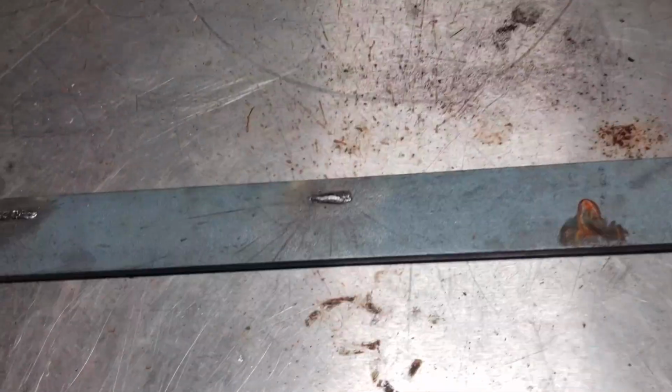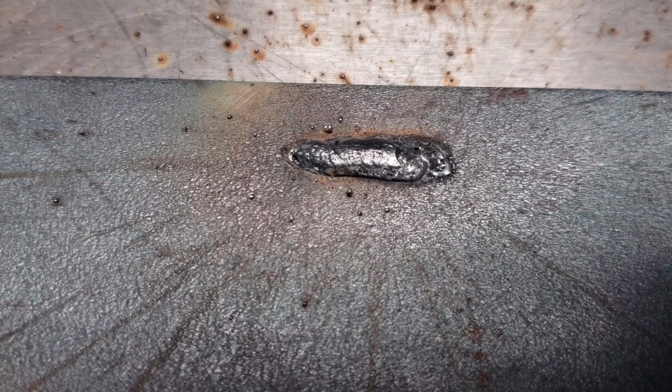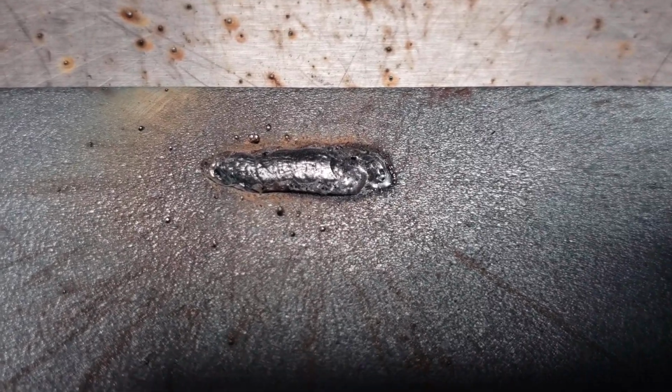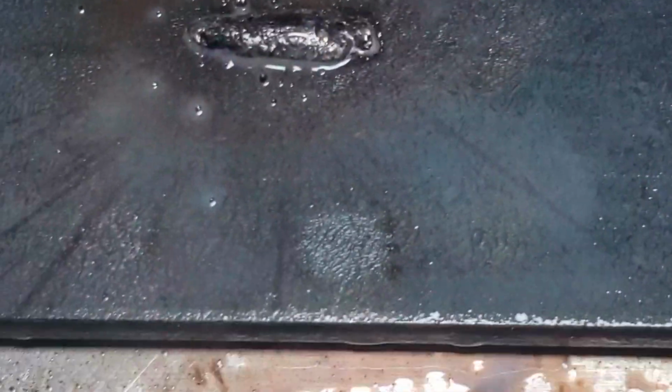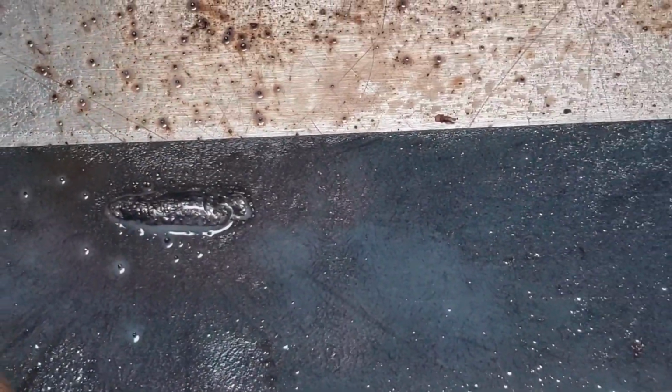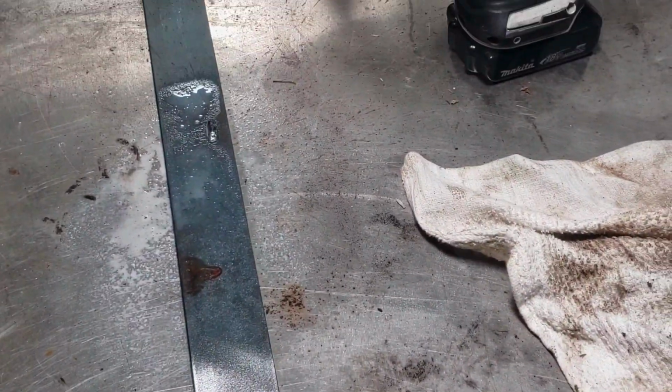It's got all kinds of benefits to it. It helps prevent weld porosity, it keeps corrosion down, and it allows the flux core coating of your weld to just be gorgeous. It says to lightly mist. I have gone heavy mist, light mist. You can now take a rag or something and wipe it down. The big thing is this just needs to be wet, essentially. And you can weld in a puddle, outside of the puddle, it doesn't matter.